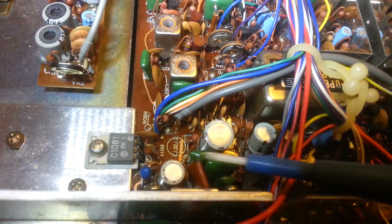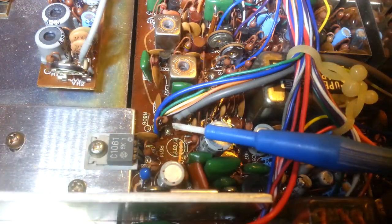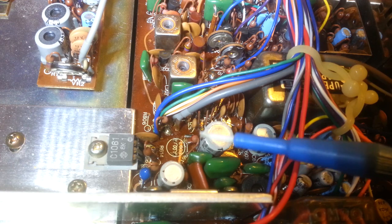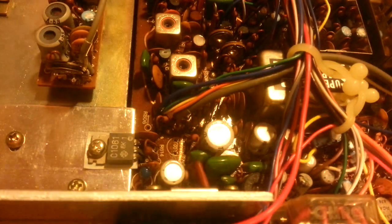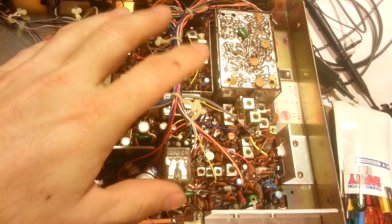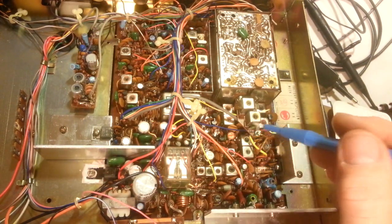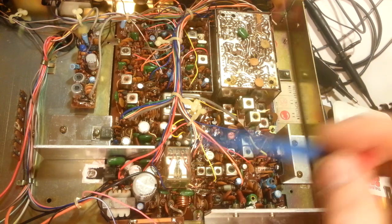It's really hard to see on camera but in person it's easy to see. If you look right there, you can see a little halo all the way around that pin, and there's another one back behind this resistor the same way. They are everywhere - they completely cover this side of the board. There are little pass-throughs all over the place, and I'd say 80% of them on this board have this problem. This is actually probably the worst one I've ever seen.